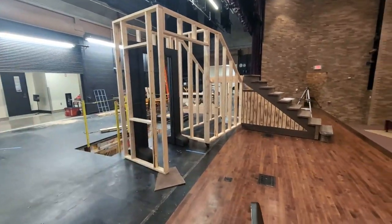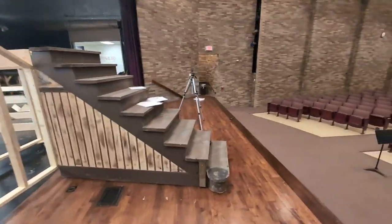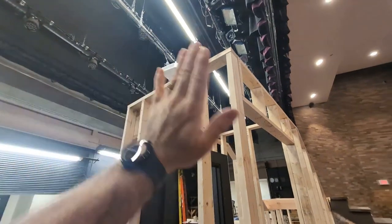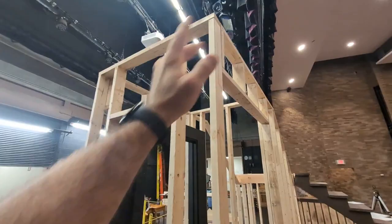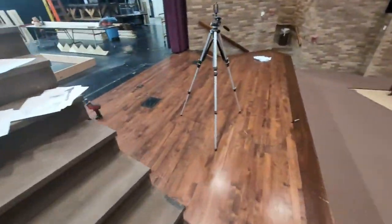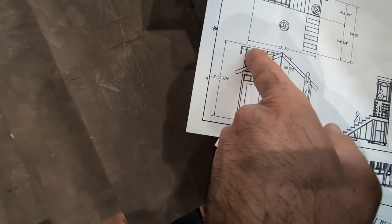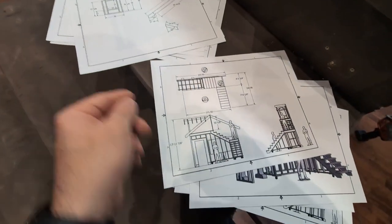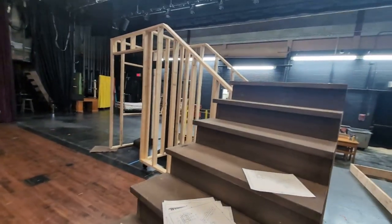So I haven't quite decided what to do here yet, but we better get to work on some of this stuff. I can make some rafters in the gable end to the dormer up there and continue to think. So your dormer gable end is almost always completely flush with the exterior walls downstairs. Your gable end wall for a dormer and the exterior wall and everything below it are all coplanar. So if I make this out of a wider dimension of lumber, then I would make the gable end of the dormer out of a wider edge of lumber too.